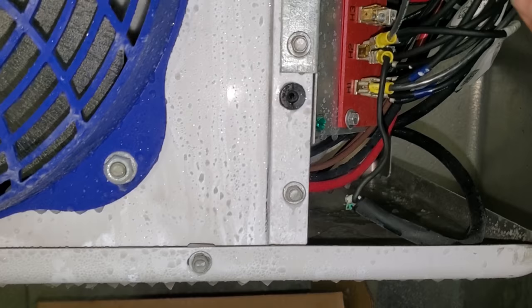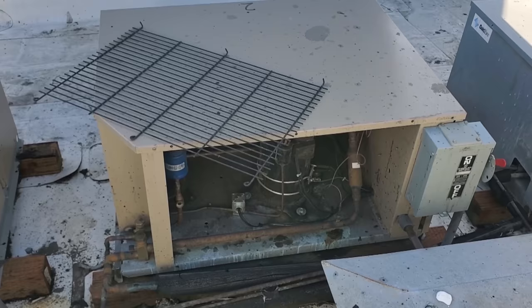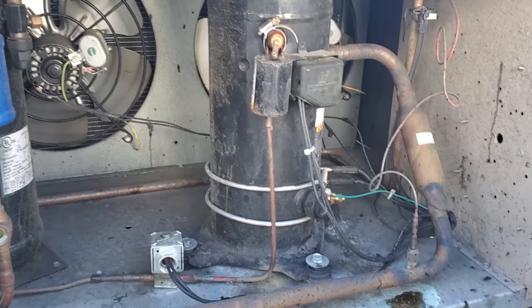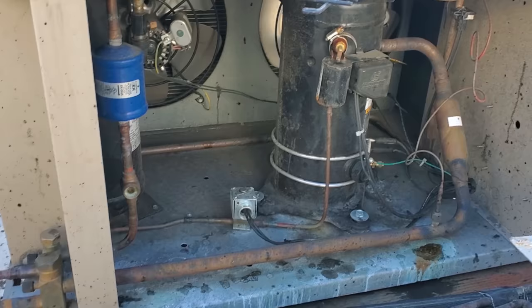What are they doing here? Why is there a jumper between H2 and F2? Oh, so that's it. We're going to look a little bit further. I walk up to the equipment - the cover's already off. I don't know if the customer's been up here. That's a low-temp scroll with liquid injection. We're going to have to open everything up to get in here. It looks like all the screws are missing too - someone's just been working on this. So just doing a visual inspection - fan blades spin, compressor's warm but not hot.